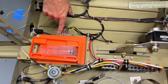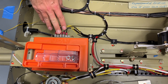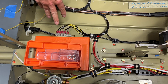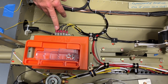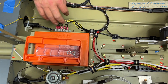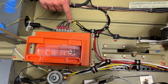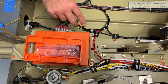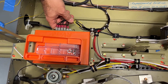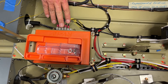I have a little ground block on this side. Some items I'm grounding back here. I'm trying to avoid ground loops — ground loops are what's going to cause any noise we're going to hear. So I'm only grounding stuff here that makes a ton of sense. For example: the yaw servo, the tail USB ground — so if there's a USB plug in the back for a camera, it's going to be there. Not a ton of stuff. If this looks like a lot for some airplanes, you should see the front.